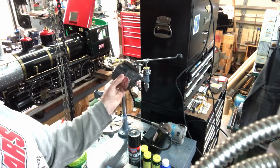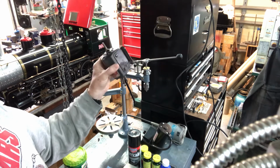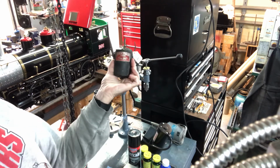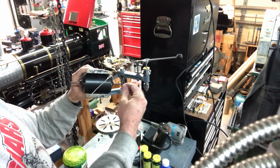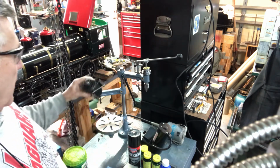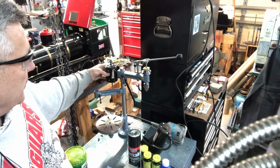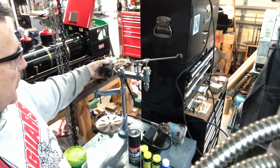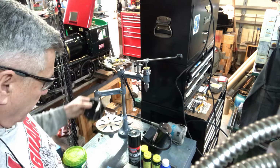Here's a small motor that I got at a yard sale. It doesn't work. I need to rewire it for sure, and maybe it needs new brushes and things, but this is kind of the thing I had in mind. It's a little Dayton motor. Looks like a sewing machine motor or something from an old-fashioned small appliance. The wires are terrible, so I really don't know if it works or not, but you could have a little bracket on the back, have a little motor, and directly mount it here, and that would be ideal. Something that size is awfully small and very convenient. It would be easy to take off and stick in a drawer somewhere when you weren't using the drill head. So that is one thought I had.